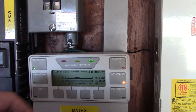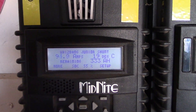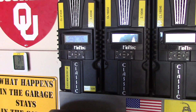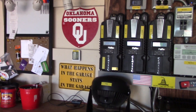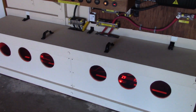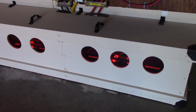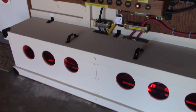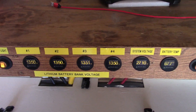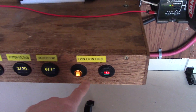So now I've got two bars here — it shows you what the house is using right here. Over here you can see harvesting about 93 amps, going down in the battery about 55 percent state of charge, running real good. I'll get a full charge today because it's great sun. For the past two winters dealing with colder temperatures and those Trojan flooded lead-acid batteries, these lithium batteries have just been phenomenal. Look at the voltages here — they're in balance: 13.5, 13.5, 13.5, 13.5.